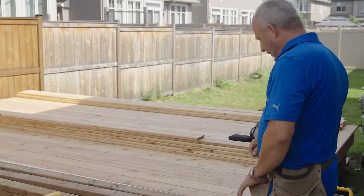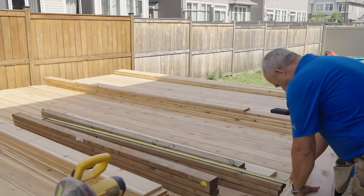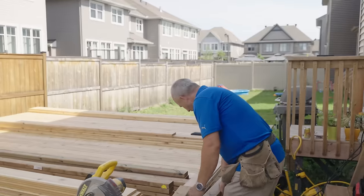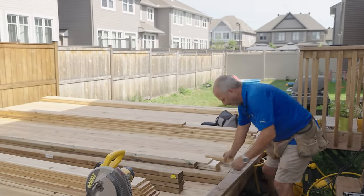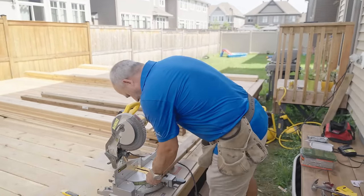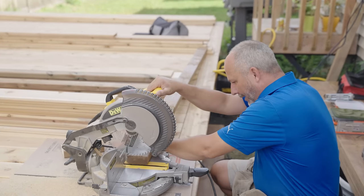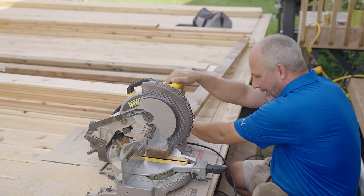And then confirm that this is indeed 8 feet long. Yep, close. It is within a hair. All right, these ones are also now cut, right? Put that in the cut pile. Bring this out. Always, always, always measure your lumber, even if it's supposed to be an 8 foot. Because when you're doing what we're doing, there's no room for extra eighths. It can actually be a little shorter. You can still clad something if it's short, but you can't work with it if it's long.